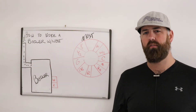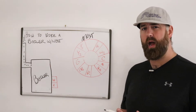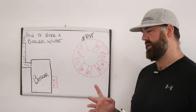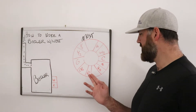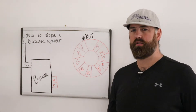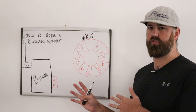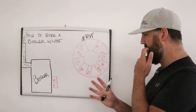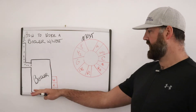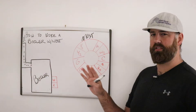OB is what they call a reversing valve and is only used for heat pumps, so we don't need to worry about it here. RC is power — on the Nest you have two terminals that let you provide power: RC or RH. If you have a dual fuel system, RC is for cooling power and RH is for heating power. In reality with the Nest, if you have only one source of heating or cooling, you can put the power wire in either RH or RC.